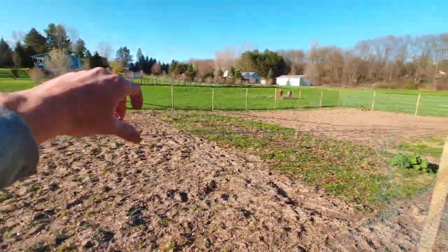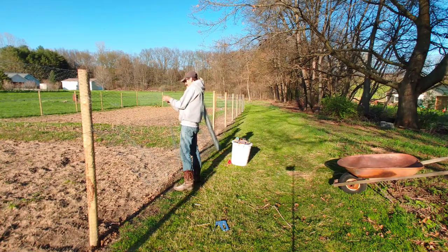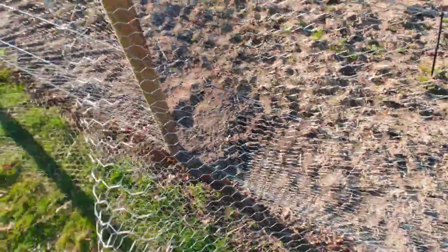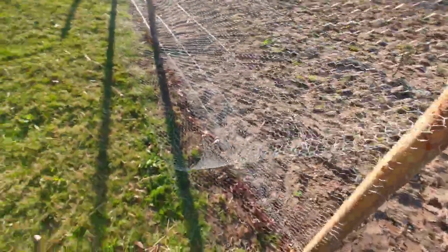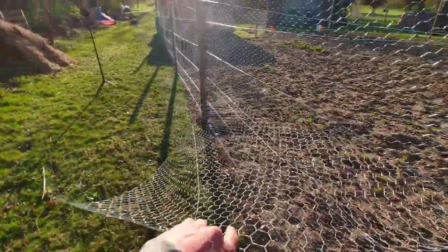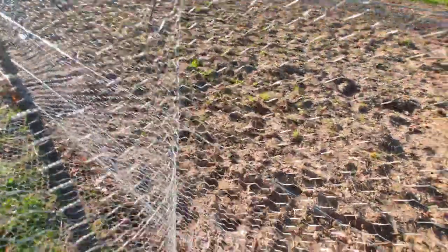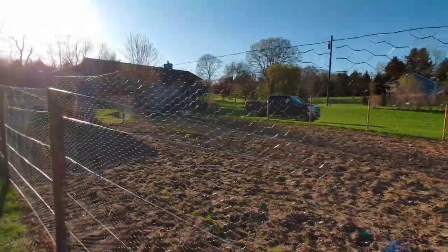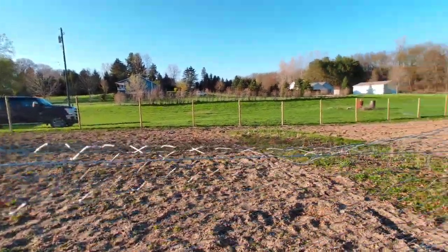We're only putting tie wraps on this level wire here and the one that meets up where our fence is already at — we're not doing anything with this yet. I got my tie wrap set up on the level wires, no tie wrap on the top wire yet and no tie wraps on the bottom, because this is the part we're going to cut since we already have a fence there. I set my fence to the next post and actually cut this down to save fencing, because the slack right here when we cut it we're going to use for the next panel.